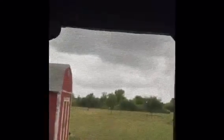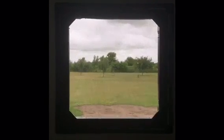The vent, this is the vent. I don't know if you can see, it fits in the hole pretty good, snugly. It's not acting right for the video, but I got it in there. And the good thing about the Sawzall blade, there we go, is that if it's a little tight on one end, you can go up and trim a little bit of it off. Okay? So that fit up there real nice. If it does that from the inside, it'll do it from the outside. Then I'll go out and screw this on after I caulk around it, and then pop the cap on it, and then let you take a look-see at the finished product from the outside.